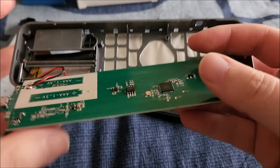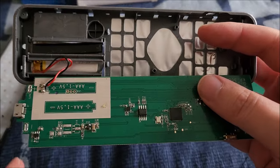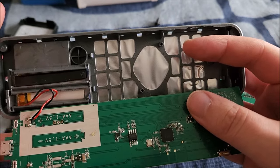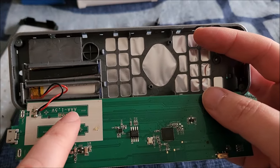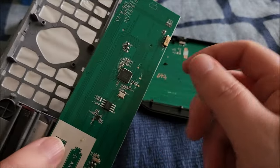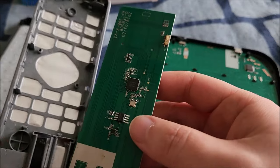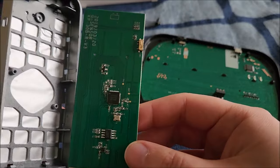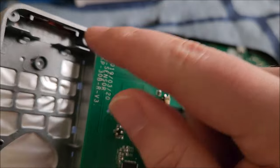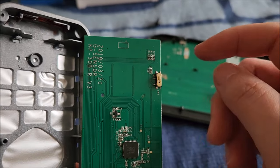You can see that originally this was designed to hold triple-A batteries — the contacts are still there. We're missing some components, but that would probably be easy enough to mod for triple-A use. It has a rechargeable battery, which is more useful for me, though for long-term storage triple-As would have better shelf life. We can also see the covered area where all the buttons should be for a second board, and what might be a spot for a microphone — maybe at one point they planned an onboard mic like on one of the other remotes I reviewed recently.